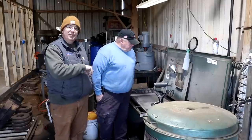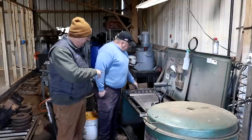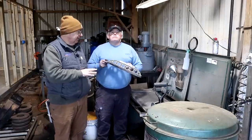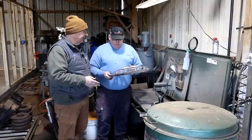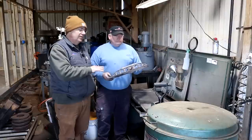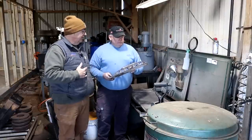We are trying to get this 18-inch one into production. I modeled it up in CAD and Fusion 360. My friend Mike Wiggins at the Backyard Machine Shop has a CNC router and he actually routed out the pattern in wood. This is a prototype pattern — we're just trying today to see how it's going to mold and make sure it's going to be good. Once we're sure everything's good, he's going to make one out of a special material called pattern board, which is a dense plastic material designed specifically for making patterns. But this wooden one we're just molding today to make sure it'll work all right, and hopefully have these in production soon.